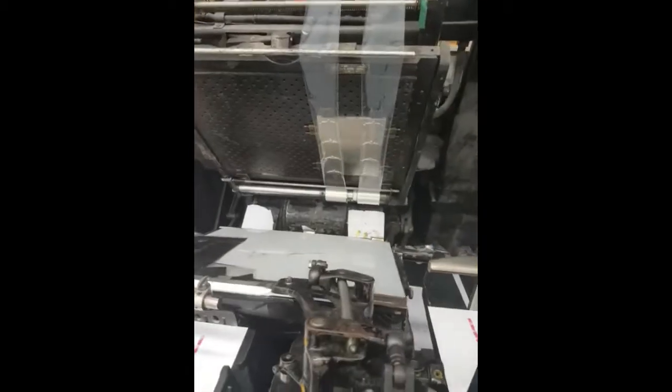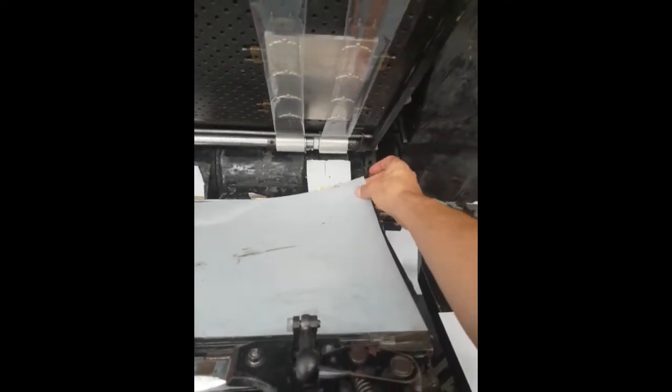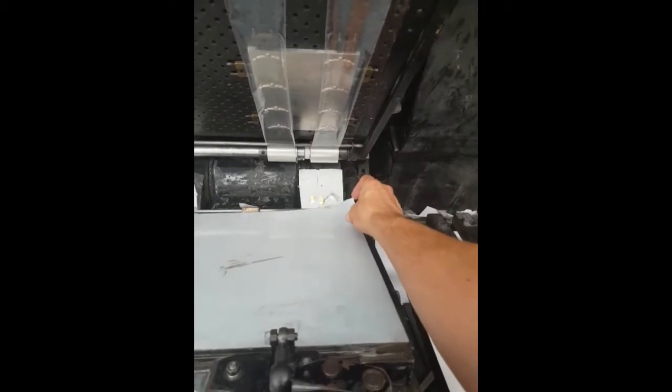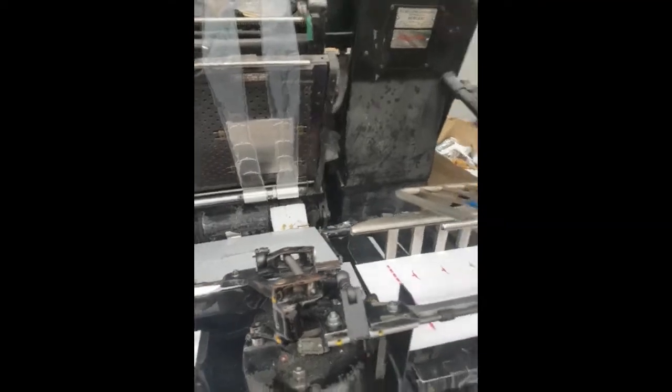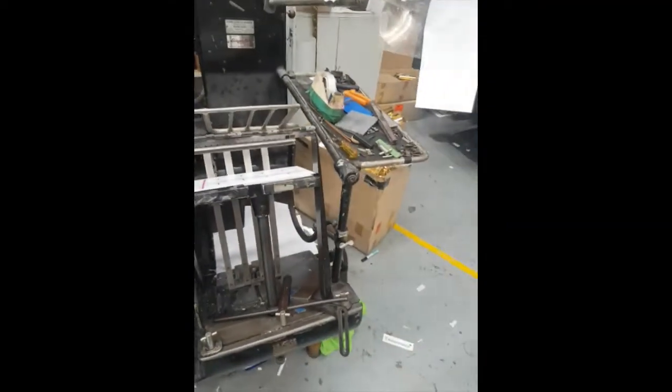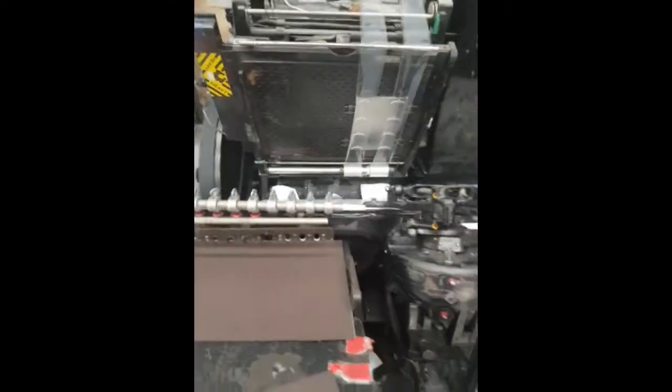This job, because it's getting mounted back to back, I'm using a hard nylon, I think that's 0.6 of a mil piece of plastic, because the impression doesn't matter on the back of the sheet. So we can really ramp up the pressure on it and get a nice clear definition to the edges. We're foiling onto a Colorplan Bitter Chocolate sheet. So what I'm going to do is take a pull and show you guys how it comes out.